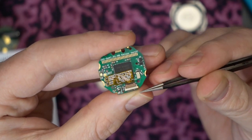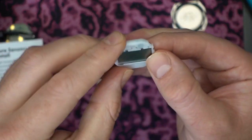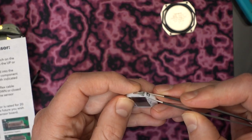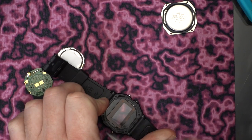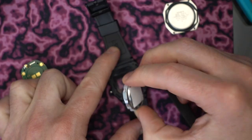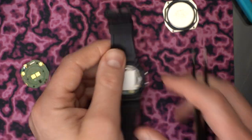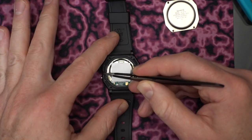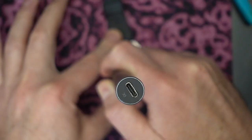Now we just got to get it back in the watch. We take the Casio's LCD frame, pop the Sensor Watch PCB into it, and using that battery clip we got off the Casio we can clip on that metal backing and it powers right up. Before putting it back in the watch I found it was a good idea to make sure the buttons were completely extended so they didn't snag on the module. Even so I still had to use my tweezers to get it in, but once it was in it seemed pretty good. Then I put the gasket back, put the back cover on, buttoned it up, and there you go.